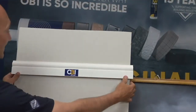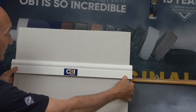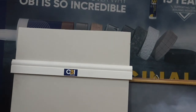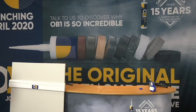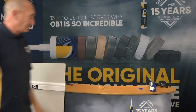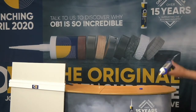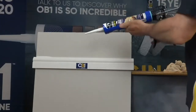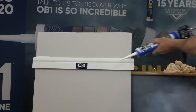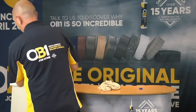And there we have, because of the grab nature and the high tensile strength of the product, we have an immediate fixing. Now we do it, raise it up like I said, just to show you the grab of the product. Okay. Next thing is we take the SIROFLEX instantly paintable caulk and we fill in that gap with the instantly paintable SIROFLEX caulk.